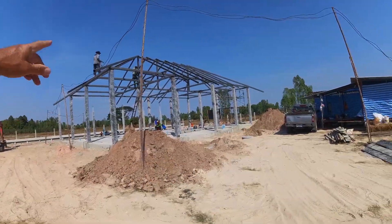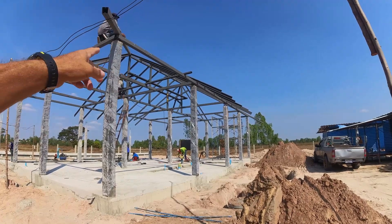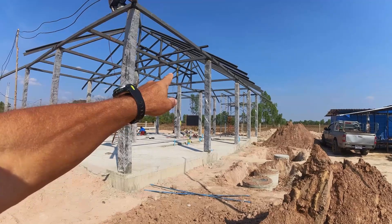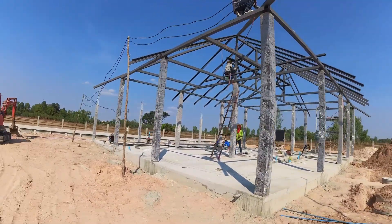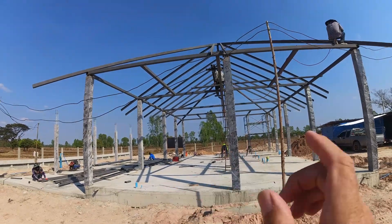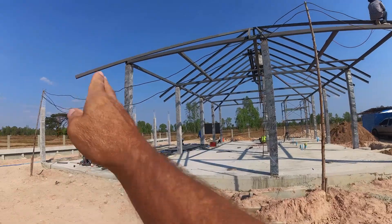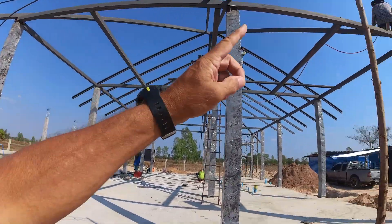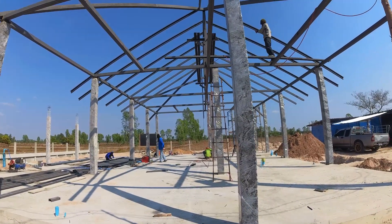The roof guys are really tearing it up — all corner beams in, putting rafters in. They've added vertical supports to the ridge beam up there. I was glad to see that because the last one on the end was sitting mid-span and didn't look right — now they've got one right above the column, so we're good. On both ends they have center tube rafters in place. The reason they're spaced that way is if this is an 8.5-meter wall, they go on one-meter centers — one, two, three, four from each end — with the half-meter right down the center. They've also added mid-span beams here and on the other end.